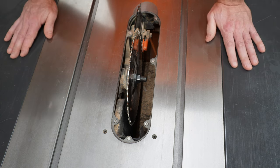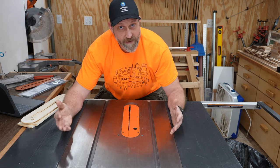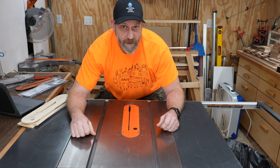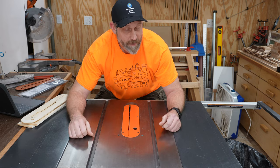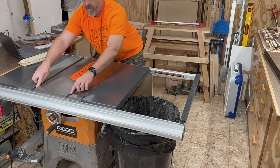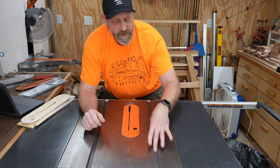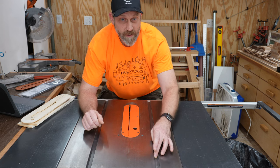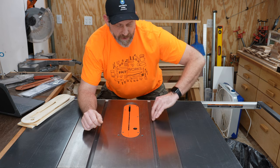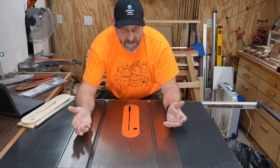Assembly for this saw is fairly extensive, but thankfully the instructions are really good and the parts bags for the hardware are well marked, as I recall. It has T-channel miter slots on either side of the blade. These two are not milled perfectly — the one I use most with my miter gauge seems to bind up in the front and the back; I think it's bowed just slightly. So again, not perfect but pretty good.